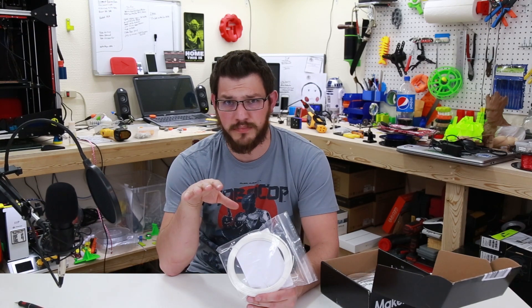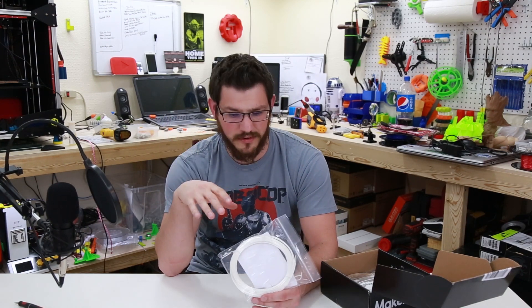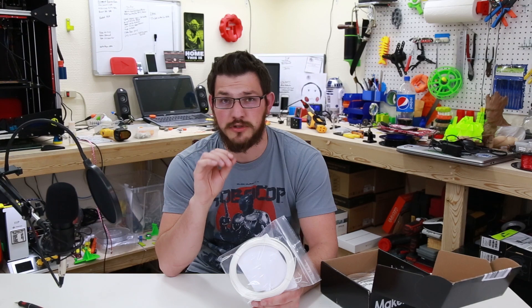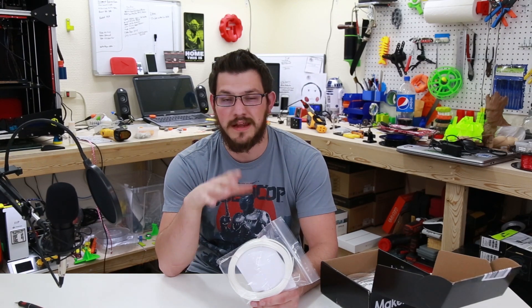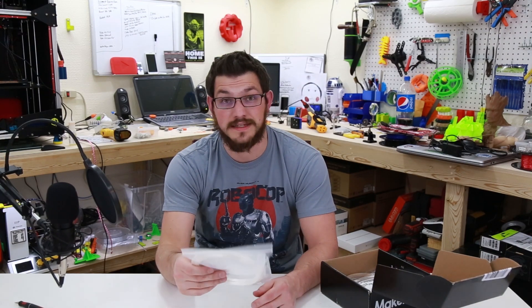When you use white filament — just a little tip for you guys — when you're doing any type of white or very light colored filaments, make sure your hot end is super duper clean. If not, you're going to get some discoloration in your prints. That's just a guarantee. I've seen it with some of my clean nozzles — a brand new nozzle printing white comes out great; a dirty nozzle, some things are going to drip off, especially if you're printing at those high temps.